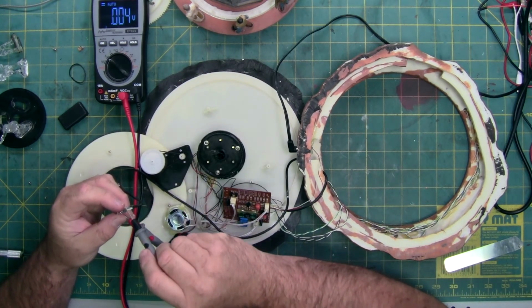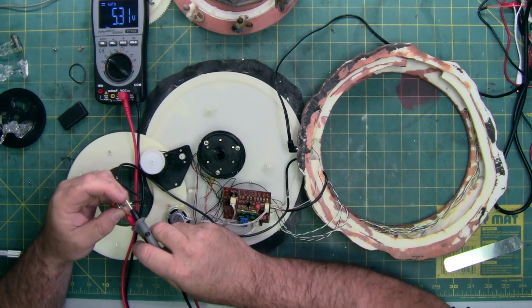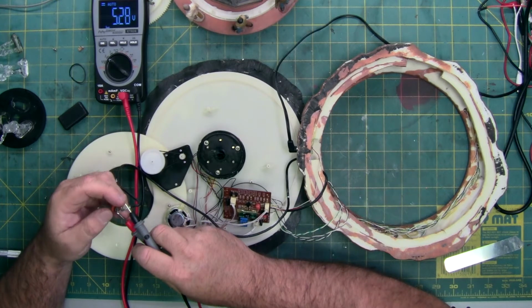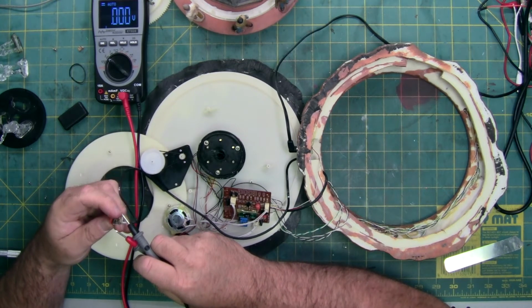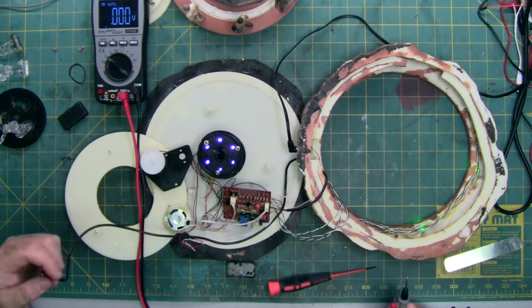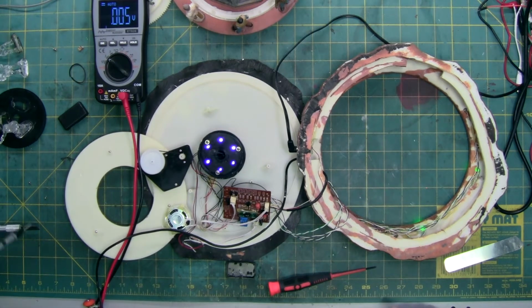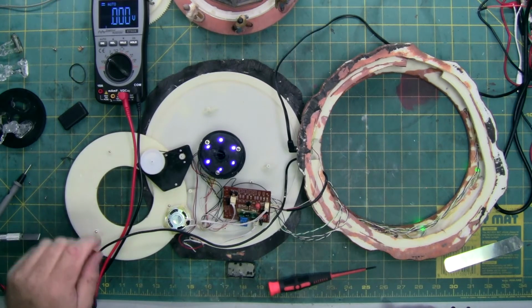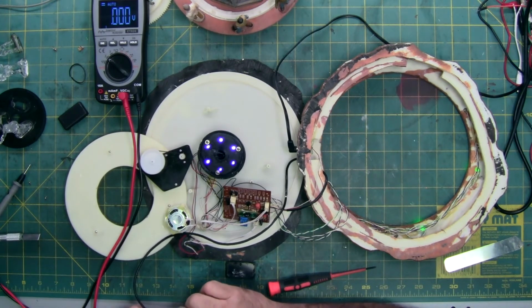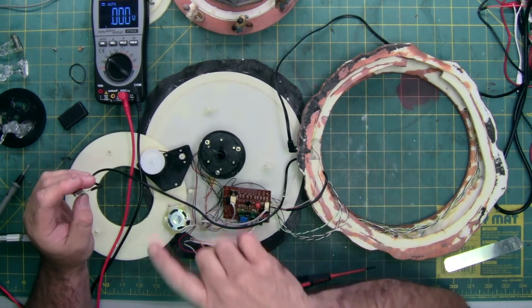Because right now the circuit board is getting power through those auxiliary wires. And the Lemax power supply is slowly increasing its voltage. Now we're going to flip on the switch. It's a bad switch. Yep. So the whole reason this isn't working is this switch.